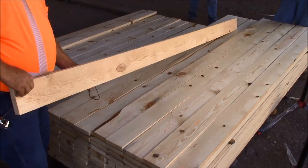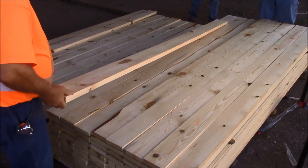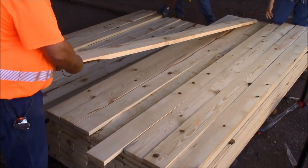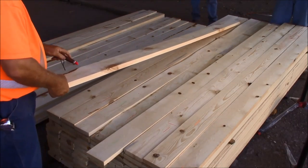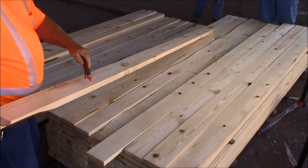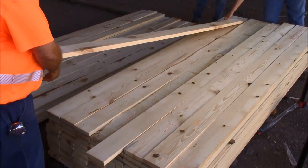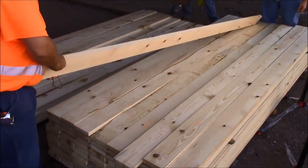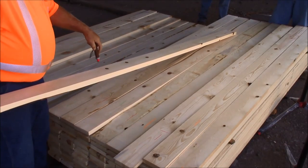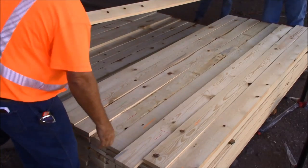Here we have a jam cutting which is almost 48 inches — that's a piece of 2 shop. Here we have sash cuttings taken down the sides, or we could actually cut that into finger joint also — 3 shop. Same here — we cut finger joint or sash cuttings, either one — 3 shop.